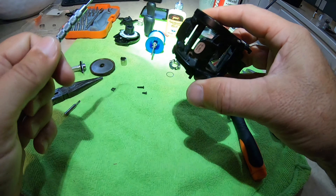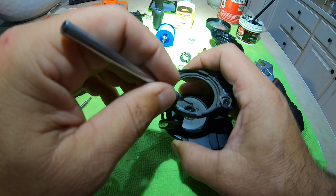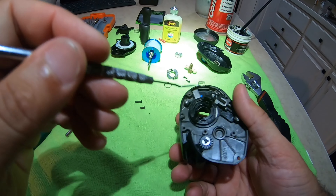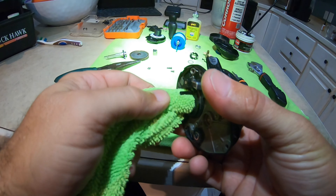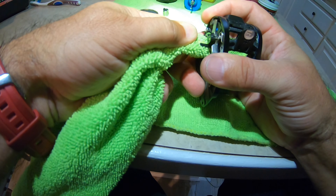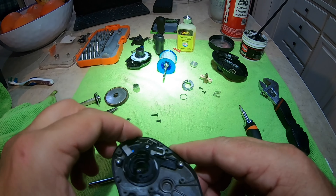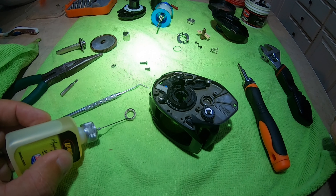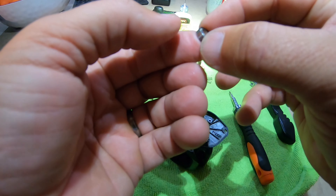This comes out — just please be gentle and careful. Come to the other side and just push it. Don't beat it and bang it or you're going to upset that whole other area. There we go — we got her out. I'm going to clean this out. To clean it out, I've got a rag — I run it through there, get it tight, and just gently pull it back out. That's my bearing — a couple of drops of oil, give it a turn.